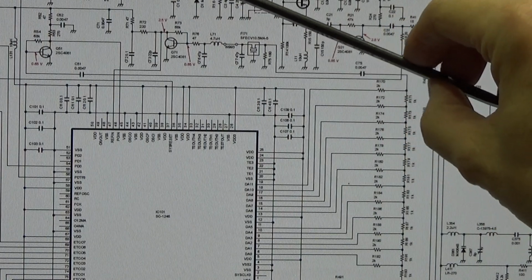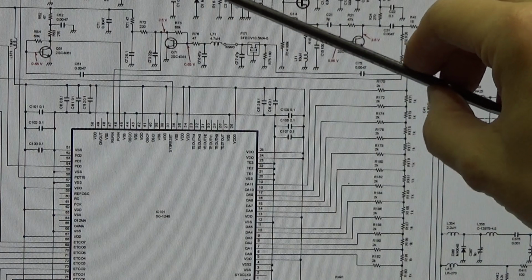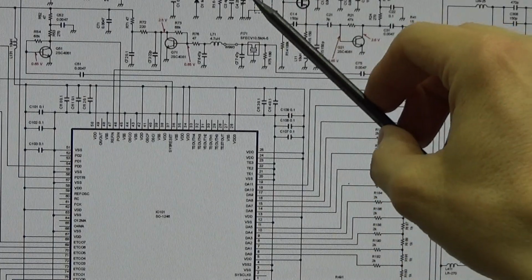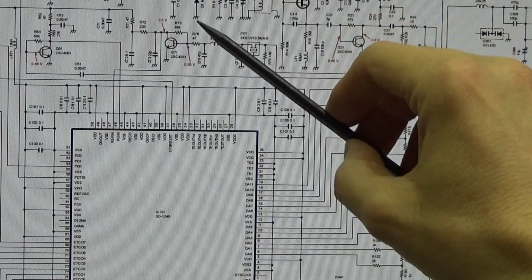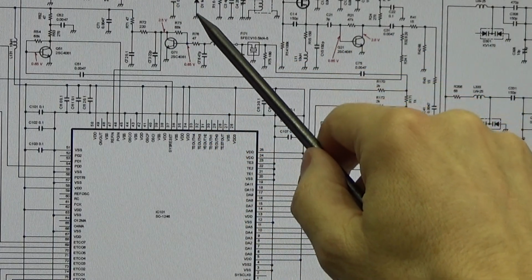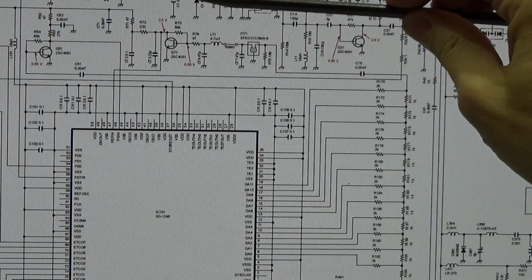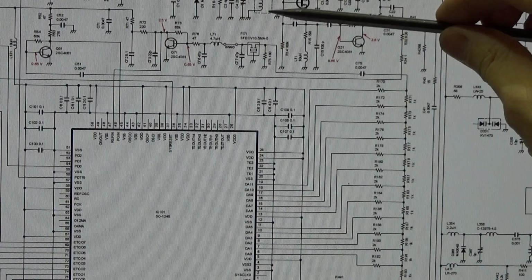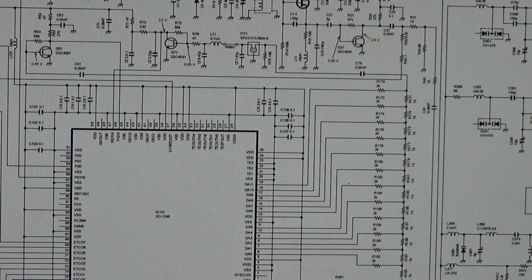And you find here a little varactor diode, so that is a cap diode, and you see here a coil and a capacitor in parallel, so that is always the indication that we have a kind of oscillator here. The oscillator frequency can be influenced if we have a cap diode in parallel. And a cap diode, as you might know, can be changed in capacity by simply putting a DC voltage onto it, right? Then this capacity is changing, and if this capacity is changing, then we simply change our VCO frequency, right? And that is all it is about.